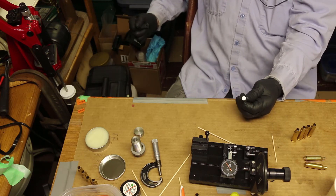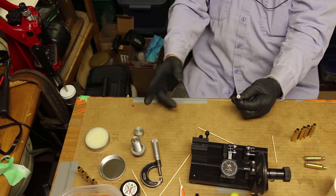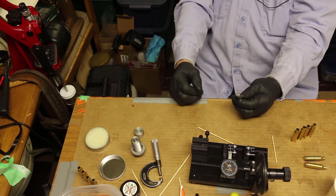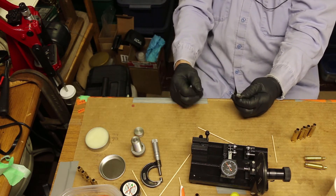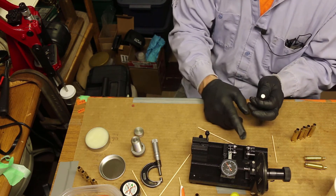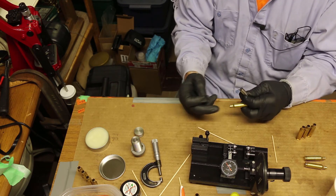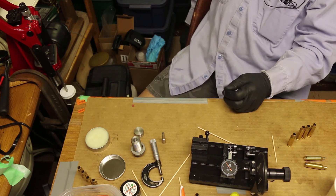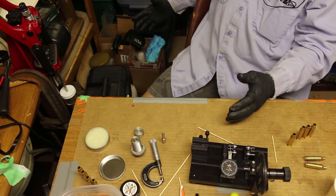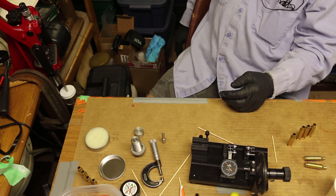The best way to do it is bring the neck down smaller than whatever size you want to use. In this case with the 262, I'll have two-thousandths compression on the bullet, then open it up with the 262 mandrel. This way all my necks will be consistent, the tension will be consistent, and provided I indicate for total indicator runout on the OD of the case — which is what's going to hold it in the chamber — bottom line, neck turning might be the biggest thing you can do to affect your group size. The inconsistencies in neck thickness can affect tension on the bullet. That's what we're trying to show you in this video. Thanks for watching.